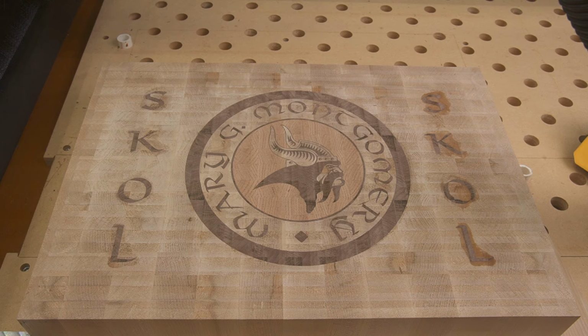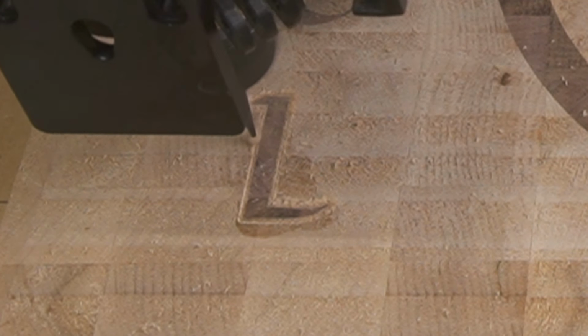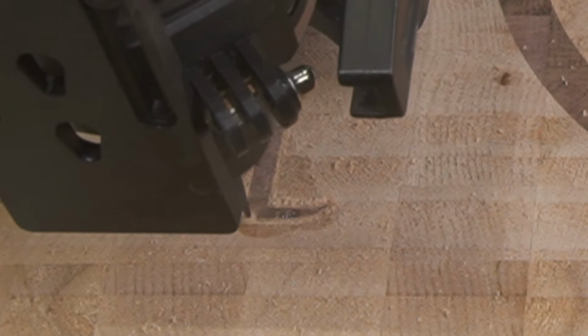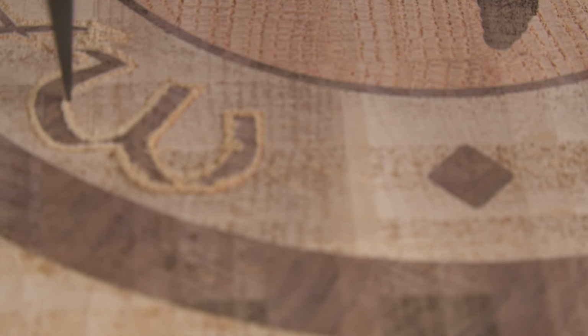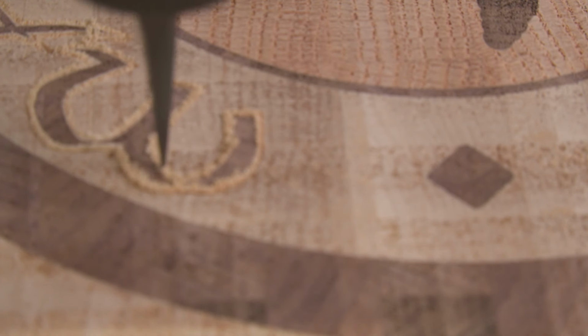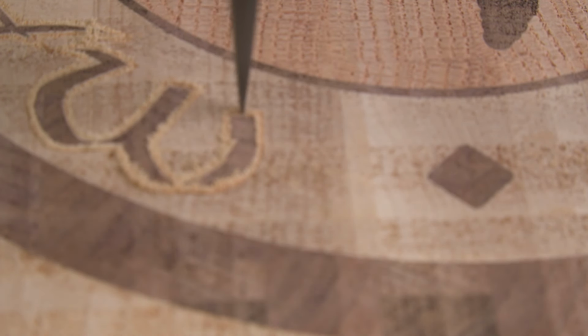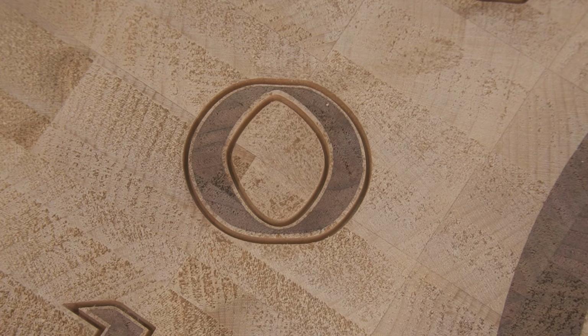I could have done it, but it would have taken me 10 times longer than he did, and I was kind of pressed for time to get this board done. So hiring someone out like Bohdan that knows how to draw these specifically to make tool paths from is half the battle. So if that's another variable, if you've had an inlay fail, your machine may be accurate, your bit settings may be accurate. It could be your graphic image, your vectors, your tool paths is what's caused the problem.